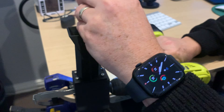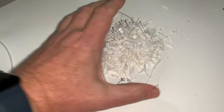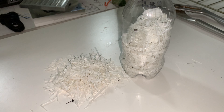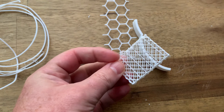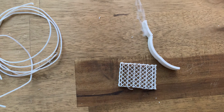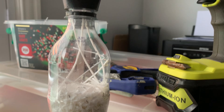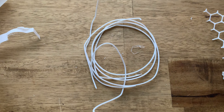After I got all that sorted it went really well. The manual mess I cut by hand probably took about 45 to 50 minutes and I got this much. In 10 minutes I managed to get this much out of the shredder. It definitely worked better on particular types of scrap — supports and scrap that's a little chunky worked best because it was able to hit the router bit straight on and not get caught jamming down the side. Actual filament was a little hit and miss until I got that metal shield tuned as close as I could.